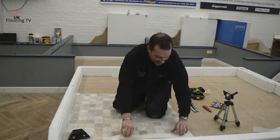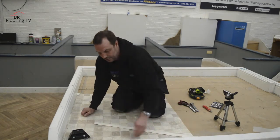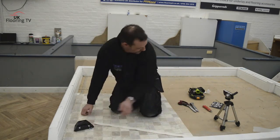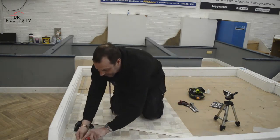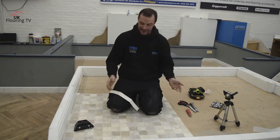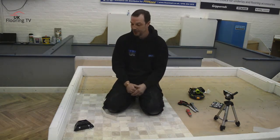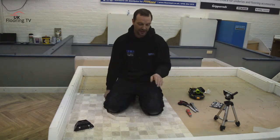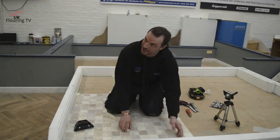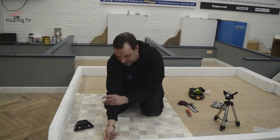It does you well to keep your eye on your cut, not just blindly push along. If you put some relief cuts as you cut, you tend to see the vinyl drops away and you can see what you've cut. I see it working well on long walls — you could get down a long straight wall quite rapid. And this is what they're for — long walls — and you just lock it in and push. Obviously, check your skirtings if they're high off the floor, you need to add extra on. I'd stop the cut if skirtings were off the floor and add some onto that.